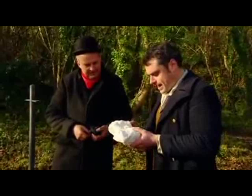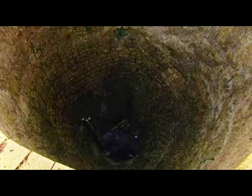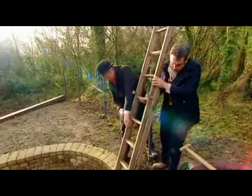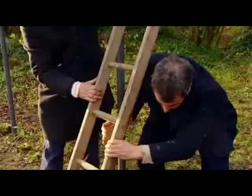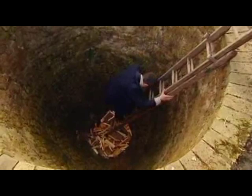So this is limestone and we need to turn this into quicklime. That's right. We apply heat to it basically, and with this kiln that involves creating a fire at the bottom which we start with wood, then a layer of coal, and then layers of limestone and layers of coal right up to the top of the kiln. The fumes are toxic coming out of the top — it's something you have to respect. The whole process involves a lot of chemistry, but the reality is it's a very caustic material — it can burn your skin. So we've got to be very sensible about the way we go about this.